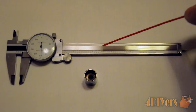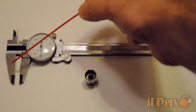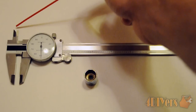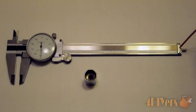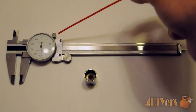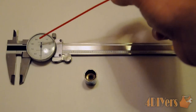This particular unit is measured in Imperial. To go over some of the basic parts of the caliper, first we have the outside diameter jaws on the front side. On the back side are jaws used to measure the inside diameter of an object. On the bottom side we have a depth probe to measure the depth of an object. There is also a lock used to lock the slide back and forth, so when you take a measurement you can lock it in place and it doesn't move until you take the full reading.